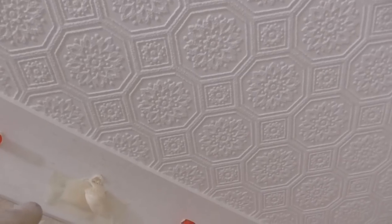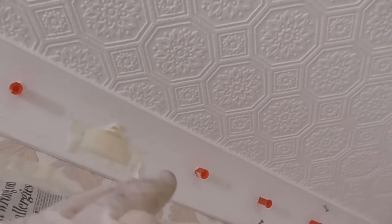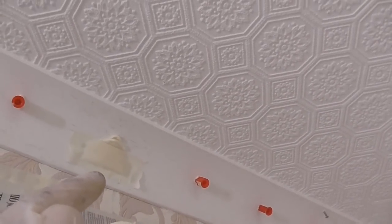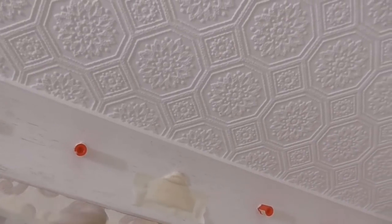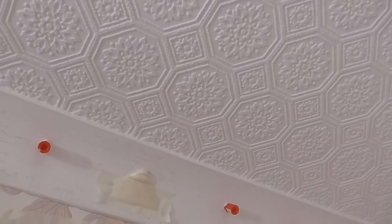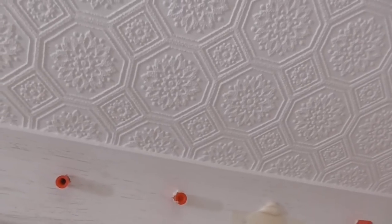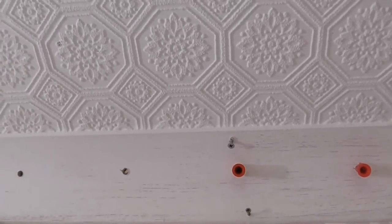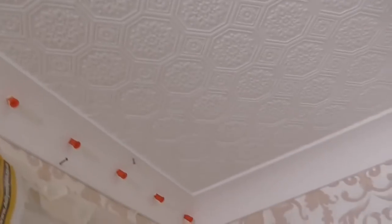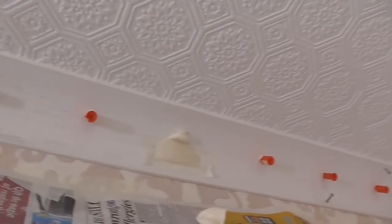This is my test patch, which you see is starting to drip. So plug them, otherwise you'll have this stuff raining down. Now where I did this test bore, these plugs won't fit. So a bit of tape will be okay for now. But get the right size borehole and these plugs are okay. Again, always leave a little bit of a space for the pressure to be moving, coming out. The foam at these ends will creep along this side, so that'll expand out, so not too bad. Just keep the pressure off it.